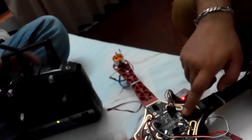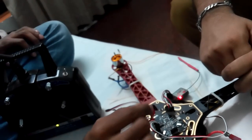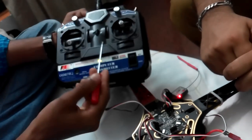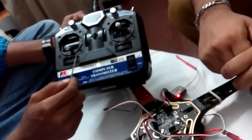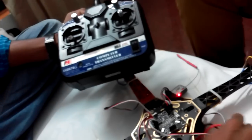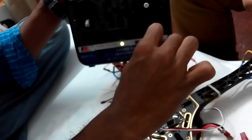The potentiometer is for calibrating the board. If you want to reset the settings and center the stick values, disconnect the battery first. Then put your potentiometer to maximum — that is 100.